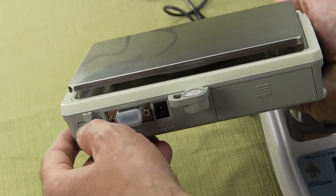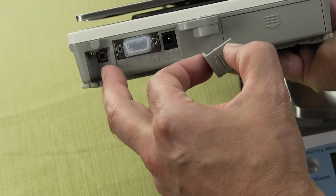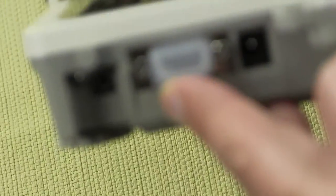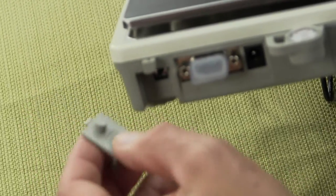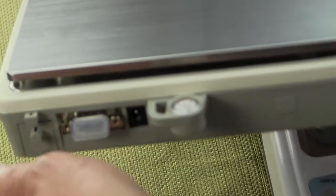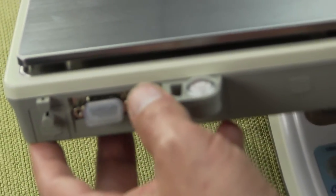On the rear of the A&D, there's a compartment — you press it down and there's a button in the center for performing calibration. The door slides up, and there is a hole in it. The reason for the hole is that weights and measures will put a wire through the back so you won't be able to press the button to perform calibration. It's what we describe as a lockout.